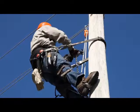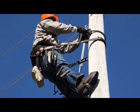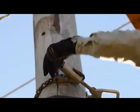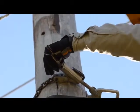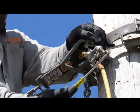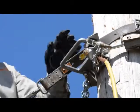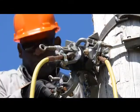Next, back down below the system neutral, a grounding cluster bar attaches to the pole with a chain binder. A wheel tightener cinches the chain to secure the cluster bar in the best position. Now the free end of the cable attached to the ground rod comes up and is clamped tight on the bar. Then another complete grounding cable set attaches to the cluster bar.